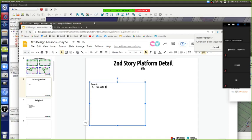I don't know. Because they're load bearing, so you want to keep everything on the long side. Keep the long side uniform, like a solid long thing. So that little edge at the end, you don't want to be resting on the end walls. You could, but we don't. The rationale there is the weight load bearing is on the long edge. So that's kind of how we decided.